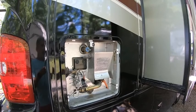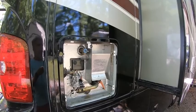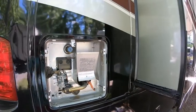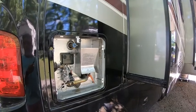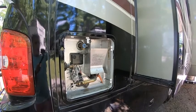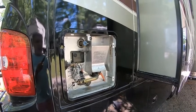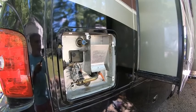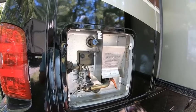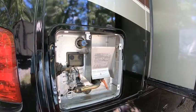Then and only then, when I've got water coming out of every faucet without air blowing through it, we'll go back and turn the breaker on here and turn the AC breaker on in the house. If you want very hot water very fast, go to the hot water switch and turn on both the electric and the gas. We're just going to turn on the electric because we don't need it super hot super fast. If you turn them both on it makes hot water faster, but I don't want to use up my gas, so I'll just turn the electric on.